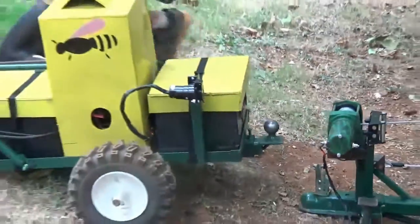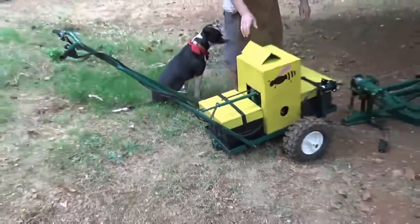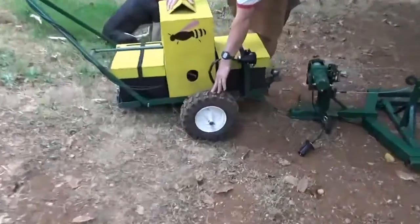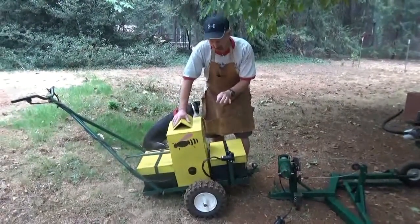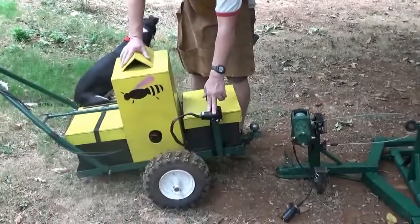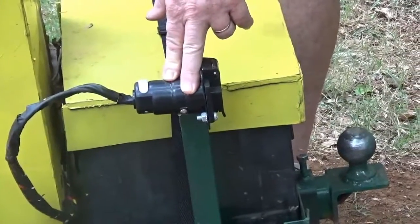There's one on the front and the rear. The wheels are now smaller — it gives me a little more torque for plowing, and sometimes I need to go really slow in the low gear. The smaller wheels help for that. I lost a little bit of ground clearance, but it still has plenty. And we have a seven-pin trailer plug, so this allows for a quick change of all the electrical implements that go on the front or on the rear.